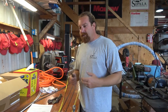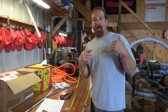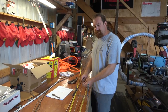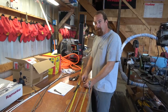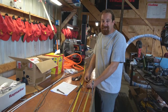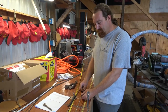So you wanna look at your rig, your standing rigging, and the spreaders, and look for any possible cracks or any possible issues in all of the metal. Swage fittings themselves are prone to cracks. Check that the cable itself feels cylindrical like it should be. A lot of times a center strand will break or pop and the cable will end up having a bump in it. That's a telltale sign that you have less than all of your 19 strands. There's only 19 strands in any of these pieces. It's a good sign that one of your 19 strands has popped at least.